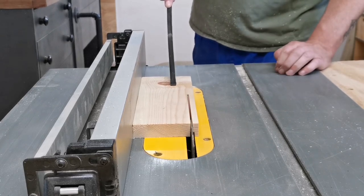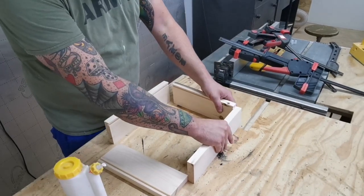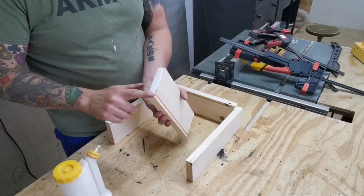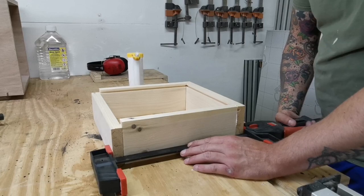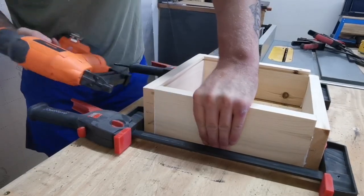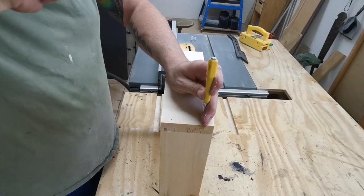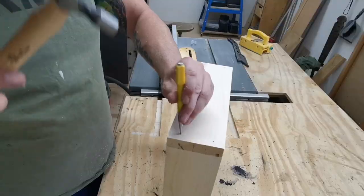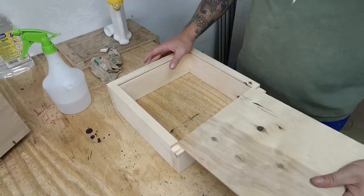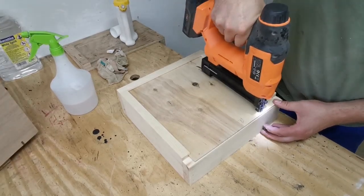For the back piece, this just gets cut off directly where the groove would be, as the bottom panel slides over the top of it. The way I construct the drawer or tray is just with glue and brad nails. I clamp up the tray making sure everything is nice and square, and then I pop three or four brads into each glue joint. Next I countersink all the brads below the surface and fill these with a bit of wood filler. The front of the drawer is going to be painted so we don't need to worry about seeing these — once everything is sanded, smooth, and painted they will be totally invisible. I then slide the tray into position and fire a few brads into the back which will hold it there permanently.